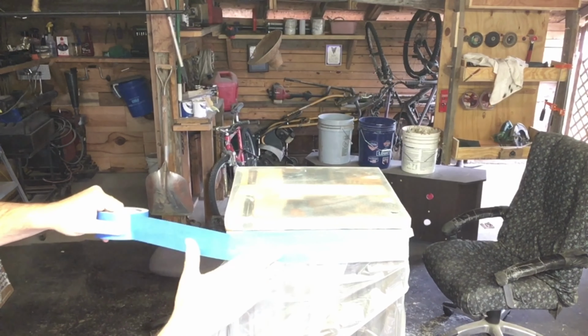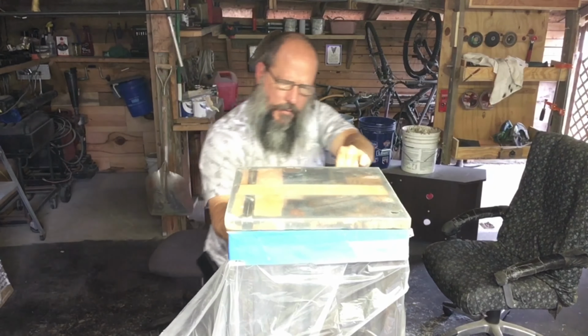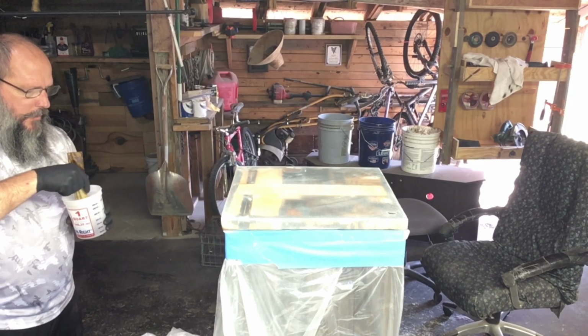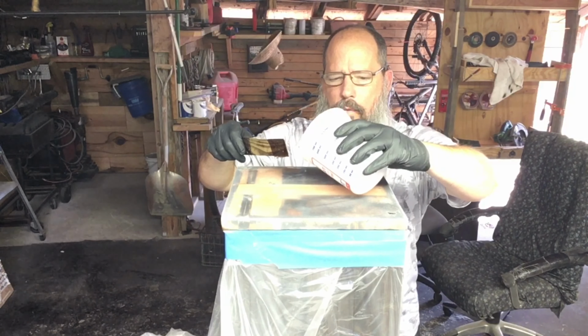So now I think you can see why I like doing that first layer of tape underneath everything. You saw how I used the little pieces to hang that plastic up under there. Then I went back and I wrapped the whole other layer of tape around the plastic to help hang it up there. Again, I rarely have any holes where I get that overspray through there if I'm painting something, or where the epoxy runs through or whatever.